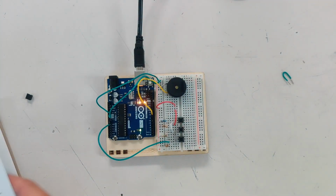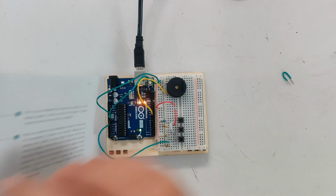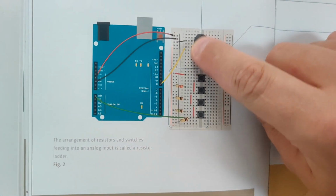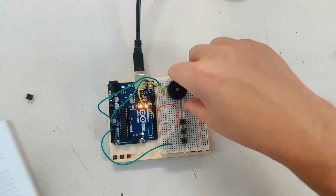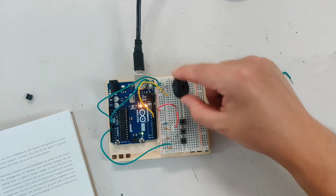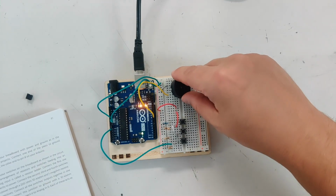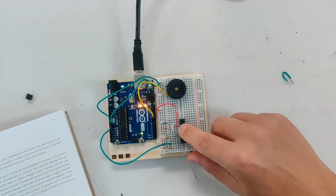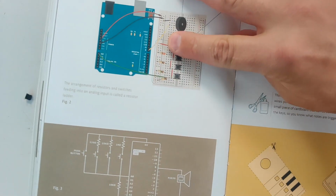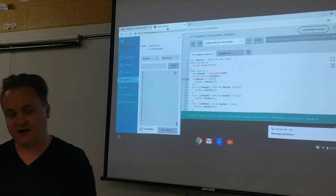If you look at the diagram, it's very close together. Well, guess what, buddy? These are on the diagram. It says here it's 2 apart, but in reality, the closest you're going to get is about 4 apart. So you have to wire it a little bit wider apart, right? So there's another warning, that the diagram up at the top is actually a little more spread out because of the piezos we have.